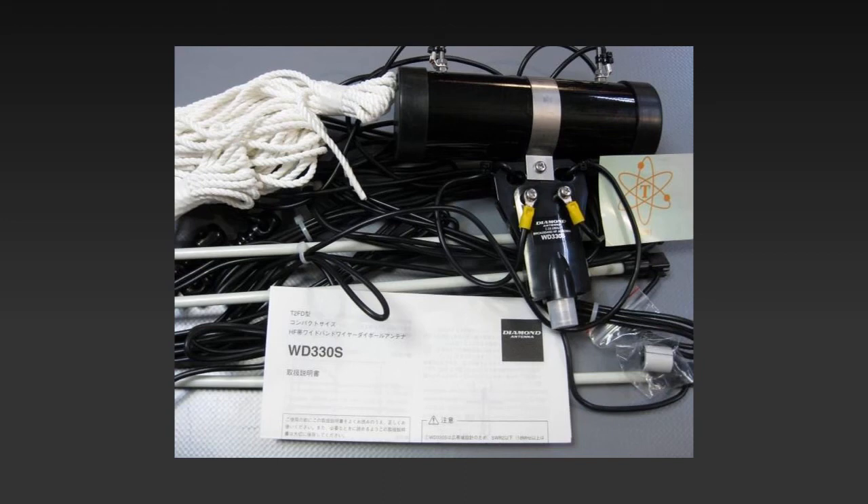This is one reason why I suspect the 160 meter band may be unusable on this aerial. Whilst the Diamond WD-330S does have some drawbacks, especially on the lower frequencies, for small gardens and limited space it may be the best compromise available. The biggest advantage with this antenna is being able to switch bands very quickly and maintain a low enough SWR for the majority of radios to tune without too much of a problem on their internal tuners. There are other aerials that produce better results, such as fan dipoles and self-built antennas.